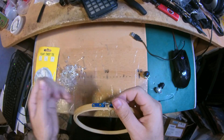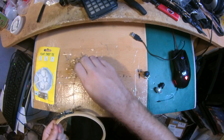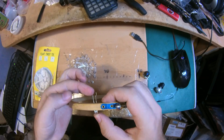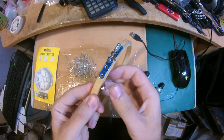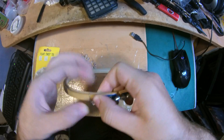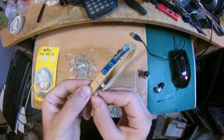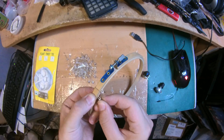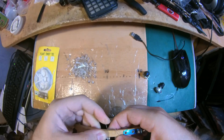I need to have enough space. What I'm going to do is place the LEDs in here like that — I'll always keep the longest leg on the left side and the smallest on the right side. I want these to look inwards, then I'm going to fold the big one outwards and the small one inwards. I'm going to repeat this process — this one outwards, this one inwards.